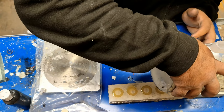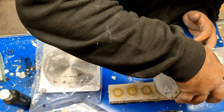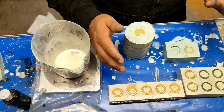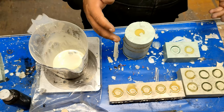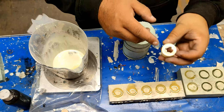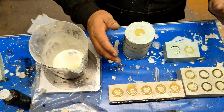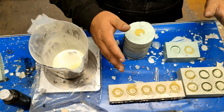So I'm not doing this as an entire full pour - this is just a quick pour to show you how it works. Sorry that this is in the way of your view. So there we are - these are all now poured. What happens is when I take these out they go rock hard, and what I'll do is take these out and sand them down on a belt sander. They don't always come out perfect - there is a little bit of work that needs to be done on them, a bit of flashing or excess. I'll sand this down and sand around the edges to make it nice and smooth. That's basically the first stage. This will take around five hours to be set and ready to be taken out of the moulds.